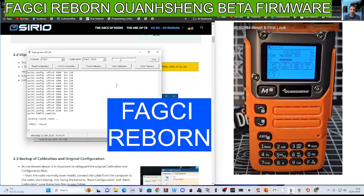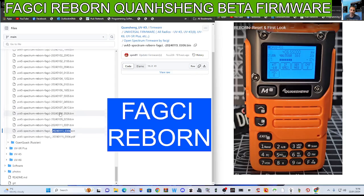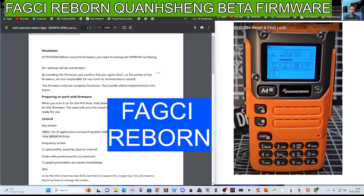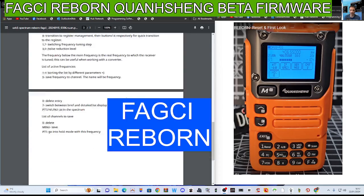I'm going to turn it off, unplug the cable, turn it on — it's flashing a white light as usual, so we're in firmware mode. Go to 'firmware' and watch this — I'll go to the Fadge page. This is how you download firmware. You click the one you want. There are many here, and there is a PDF which I have converted into English so you can read the instructions. There's a big disclaimer on this, and there should be, because it's very risky. It says: 'Attention — before using firmware you need to back up the EEPROM via the K5 program.'